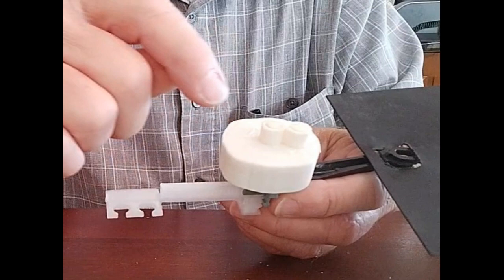Make sure they have pretty clean edges, because what you want to do is have a clean edge and clear it out of any debris that may have come off with your sanding. Slip that piece of tubing on there one time and let it set. Don't be moving it around, because when it breaks off those nipples, you have to pretty much reprint the whole thing.